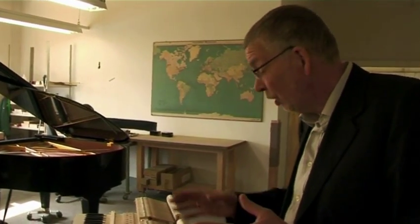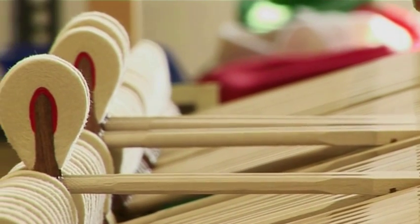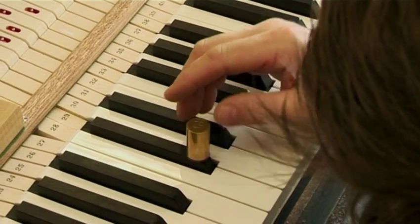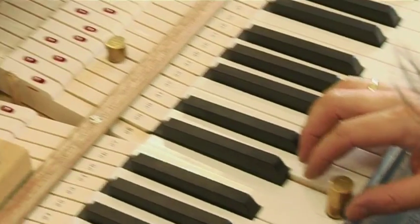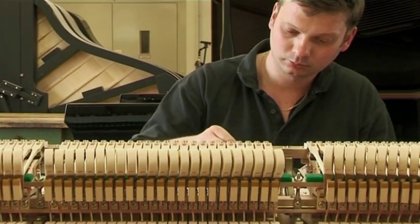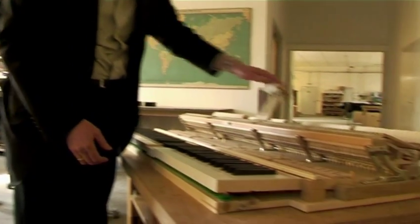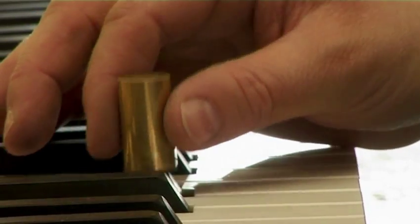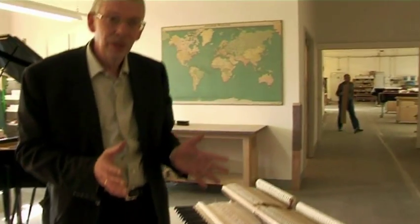The most important aspect of this process is a tactile ability, the experienced fingers or tactile senses of our master craftsmen and women. To illustrate this, we can say that the player implements a specific amount of energy on the key, depresses it at a specific speed. This activates the action levers, which in turn cause the hammer to hit the strings. The player can subtly adjust or manipulate this playing process and thereby create the desired sound, be it soft or loud, quick or slow, using the specific frictions caused by the finely adjusted action parts and springs.